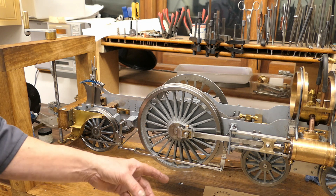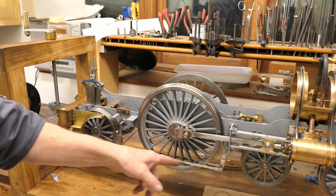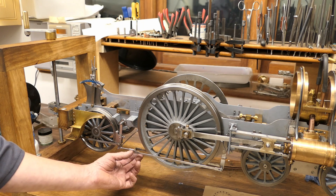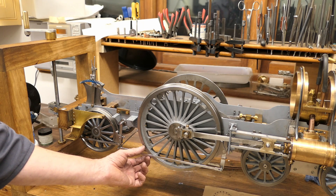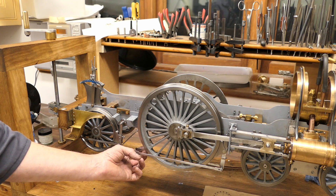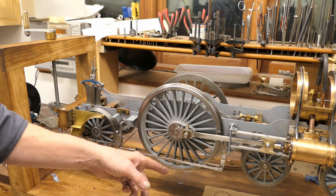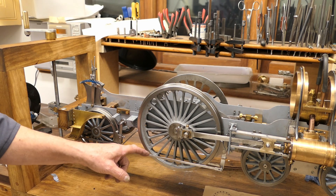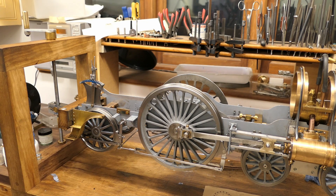One of the things I'm not happy with at the moment is the brake pulling arrangement. The design will only allow something like 30 thou in total difference between the width and the wheel. Whilst it looks right, it is very very close, and I would prefer it to be just a little bit bigger — so I may end up remanufacturing that.